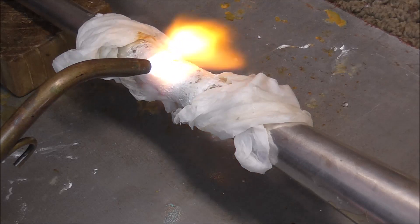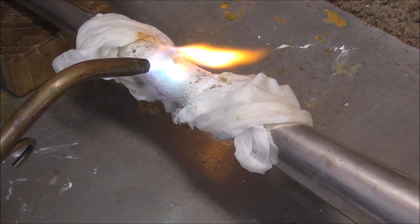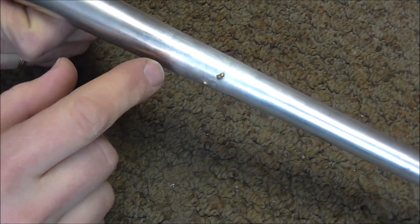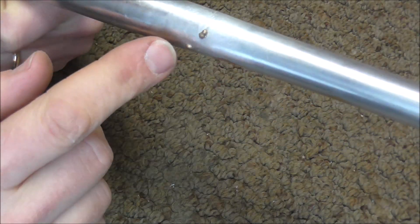I can't really put the solder right into the heat because where the flame is, it's going to melt the solder really fast before it even hits the metal. So I need to get the metal up to temperature and kind of move the flame away a little bit. This job is rather tricky because of the way it's set up. The solder melted before I even got it to the metal. But as soon as I take the flame away, it's going to cool off to the point where the solder will not go in there. I have all three cracks filled in and now I have to file down the bead of solder that's stuck on there.